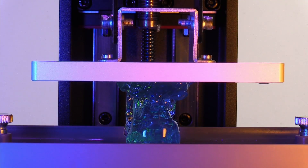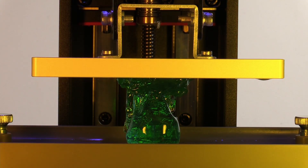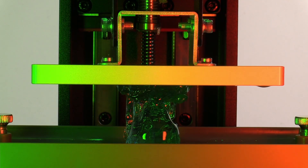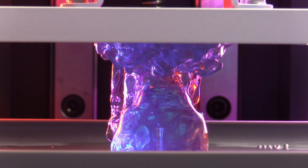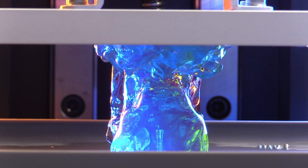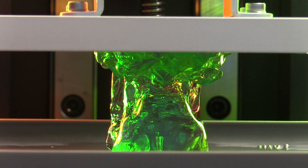This printer has a usable dimension of 12 x 6.8 cm and it can print objects to a height of 19 cm. The printer uses a monochromatic LCD screen to cure the resin and uses 405 nanometers ultraviolet light to make that happen. The printer prints files from a USB stick and it can be used with ChituBox and other slicers such as LongerWare and Lychee, and the fact that this printer is compatible with other slicers is very important, but more on that later in this video.